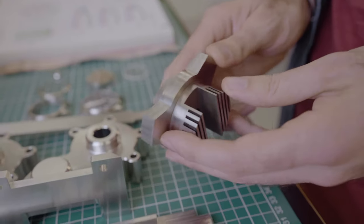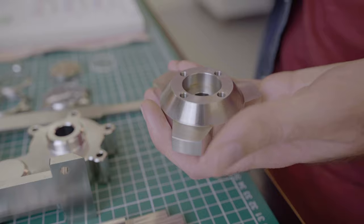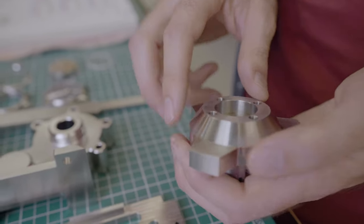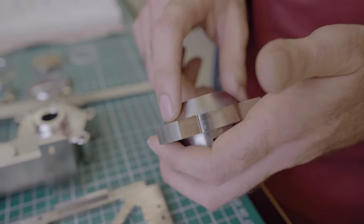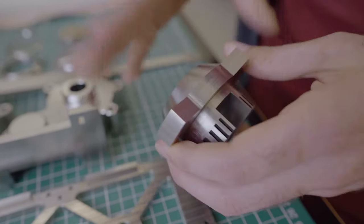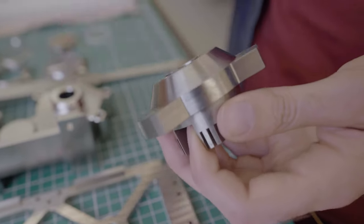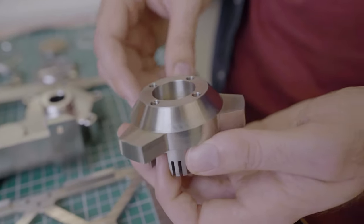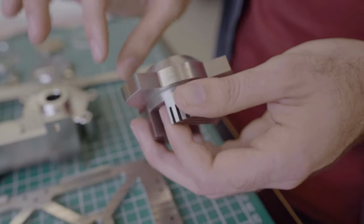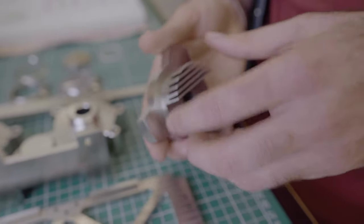This part is 304, not 304L, so different carbon content — you can see the color is very slightly different, probably because of the different raw material. With this geometry, we made it using a turn-mill combination: you can see the milling marks on the side done with a very low surface roughness — purely as-machined, what we call smooth machining. You can see all the turning marks; the surface state is quite nice. This is really an engineering-grade part showing the capacity of this metal to have a really clean surface state when machined with proper feeds and cutting tools.